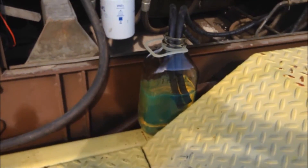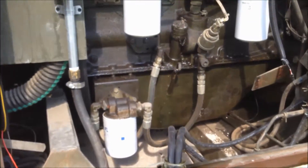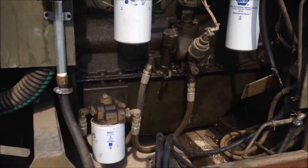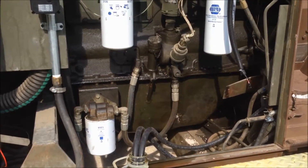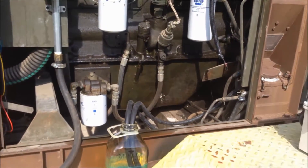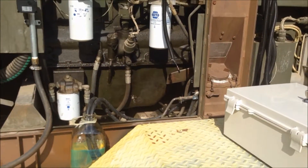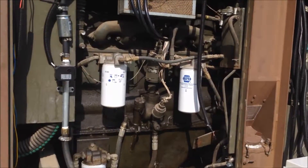We're set at about a 50-50 mix ratio here. We're kind of limited as to the pressure we get from the local gas company to get enough pressure to actually run. This is such a big generator — 30 kilowatts — that it takes a little bit higher service pressure to hit the 70-30 ratio. But 50-50, hey, I'm happy with that. That's a good ratio. We normally shoot for 70-30, but for this demonstration it'll work out great. So there you have it — a real world scenario that shows actual fuel savings when running on pipeline natural gas on this big military 30 kilowatt generator. Thanks everybody for watching. Have a great day.